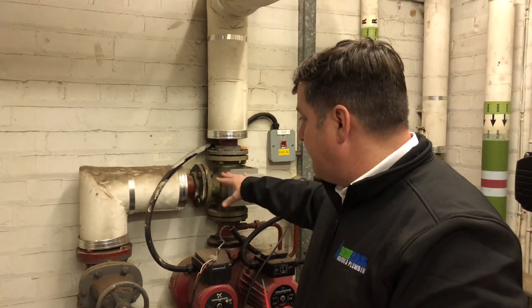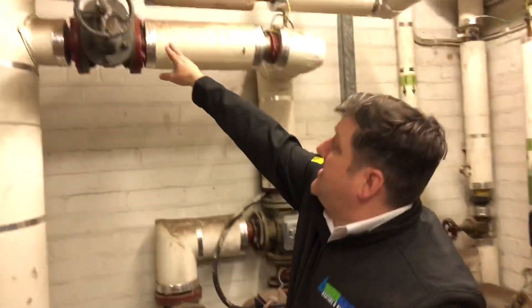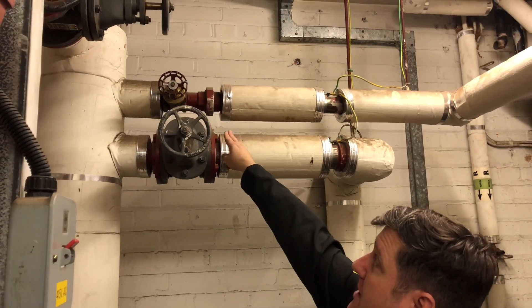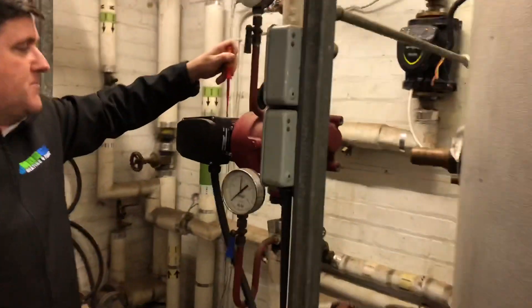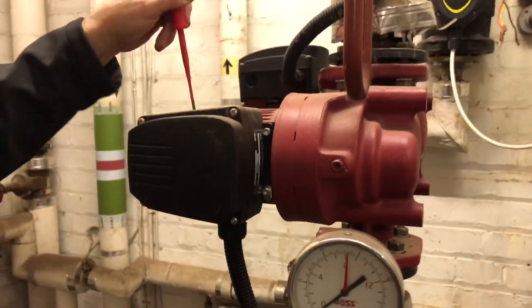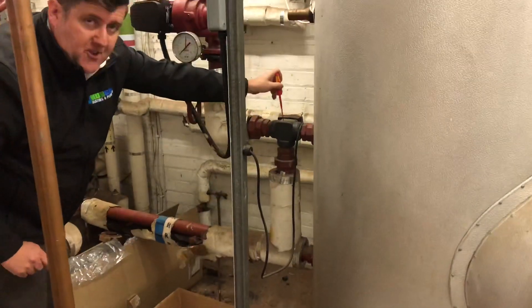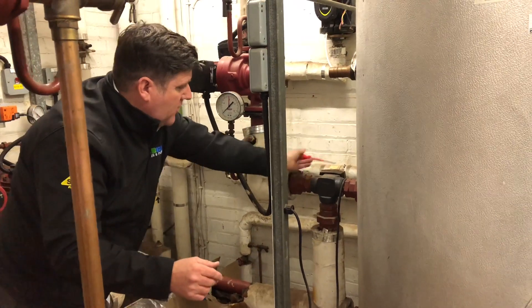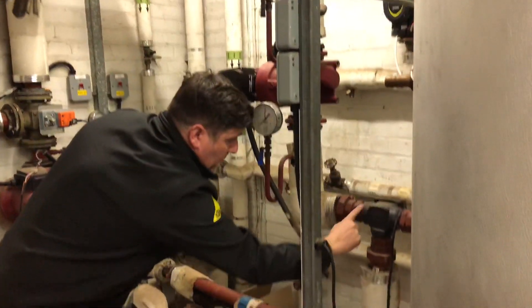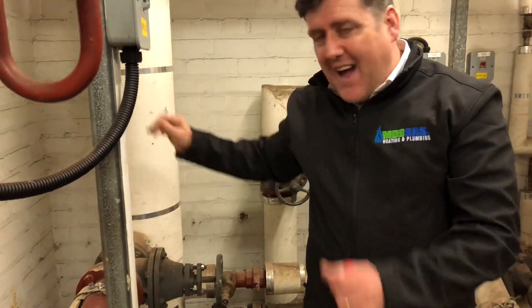Then that comes down and these pumps are your hot water primary pumps — these pumps only serve the hot water circuit, as you can see. Then again you've got another three-way valve. It's not exactly like a domestic three-way valve but the principle is the same. If the hot water requirement is satisfied, it will close and the pump will just pump it back around and back into the low loss header again. It is exactly the same as a domestic system, but on a bigger scale — and a hell of a lot easier to work on.